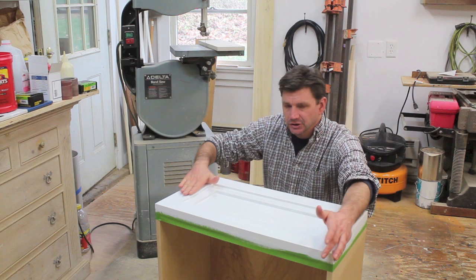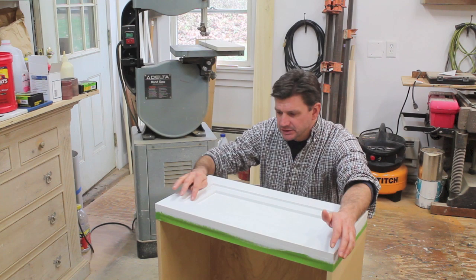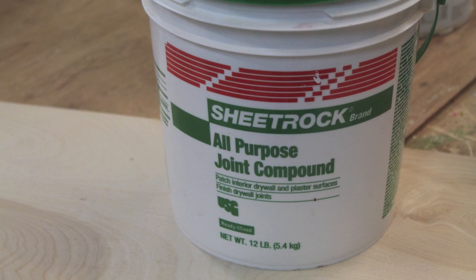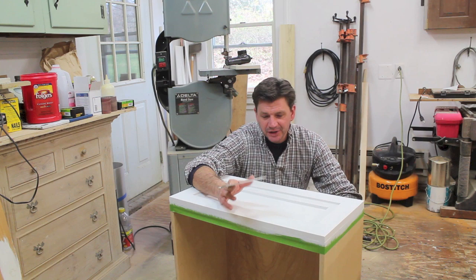It's been about an hour and the primer is now dry. If you run your hand across the surface of the drawer you'll feel that it's very rough — that's because the primer has raised the grain. The painted surface will now need to be sanded. At this point I like to fill any nail holes and imperfections with joint compound. I fill the imperfections after I've got one coat of primer on the project, because the primer makes it really easy to see any imperfections — they just stand out, so I don't miss anything.